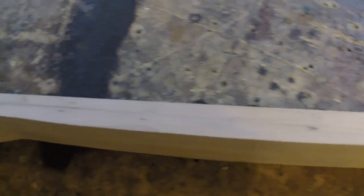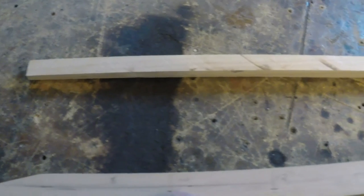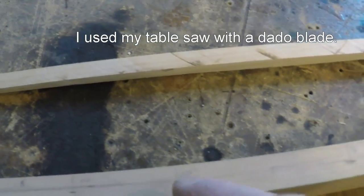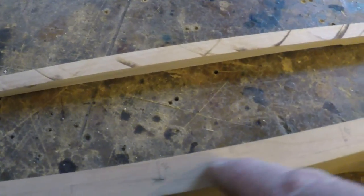I made some basic drawings here. You notice I've got a sort of bow here — it's just a bunch of straight depths, these are all 32nds, not millimeters. Here's my cut: I measured the height of my saw blade, and at 8 that's the depth of that cut; then I stopped here and raised my blade up to make this cut to 10, ran it all the way across, went to here and made it 12, ran it all the way across, then for this area made it 14 thirty-seconds. What I have is basically a curve. I've got this curve in here now.